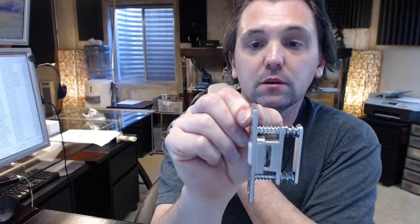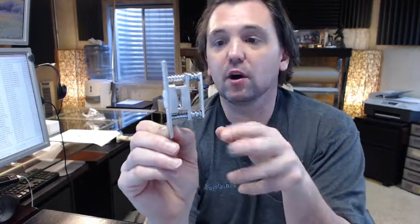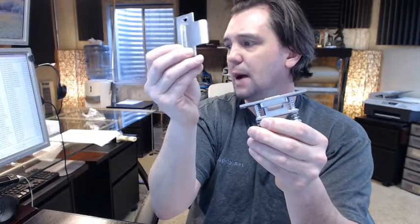Then you'll do what we would call the plate, and that would only be the 3 3/8 by 1 inch wide by 5/32 thick plate. You would just skim for the plate, and then square out the corners using a corner chisel, a specific chisel made for squaring out corners. That's how I would go about doing that. If you're doing just one, sure, but if you're doing more than one and you have a recurring need to do these, it's really worth the investment to set up and get all the right tools, meaning routers and fixturing for the edge of the door or top of the door too. This could be used at the top of the door, although this strike is probably not the most common for the top of the door, but nothing precludes it from being used there as well.